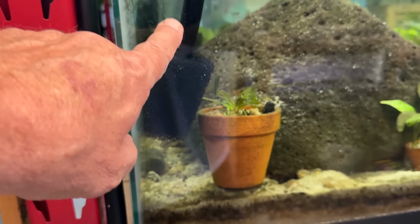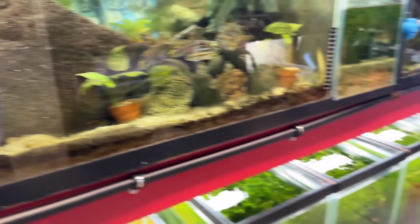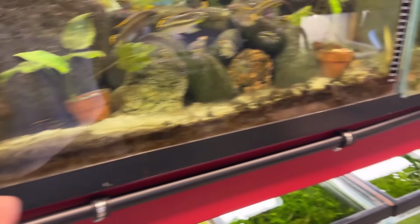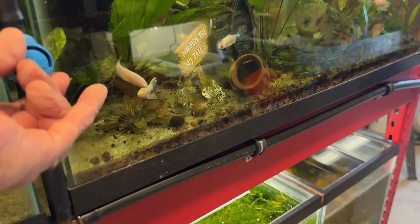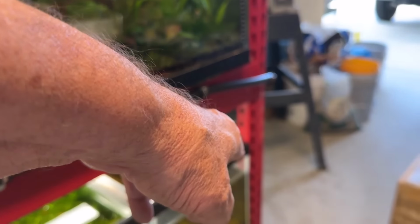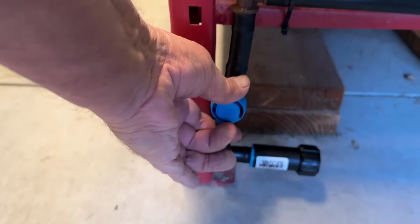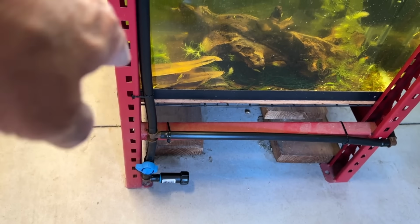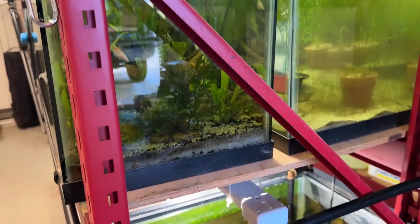Now, when I want to drain this tank, let me back up a minute here. After these pipes are all charged and all in the off position, I'll shut off that last valve down there. I'll shut off this valve down here, and that'll keep the whole system charged. Then when I'm ready, I'll hook up the garden hose down there, and I will open this valve, and I will open whatever valve I need to start draining the tanks.